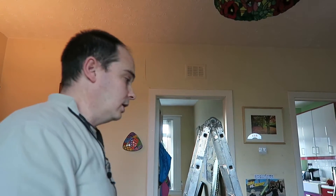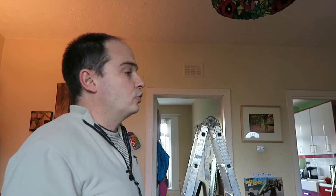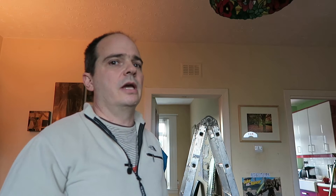What I'm going to do now is drill those holes and get some sort of fixing in there. Now, I've got a lathe and plaster ceiling — it's an old traditional type ceiling, pretty weak. Most people have a plasterboard ceiling in the UK. You can use butterfly fixings for this, which go into the plasterboard and open up — they're pretty strong, well strong enough to hold that. You could use the curly-whirly ones that drive into the plasterboard, but they're not as strong as the butterfly fixings.